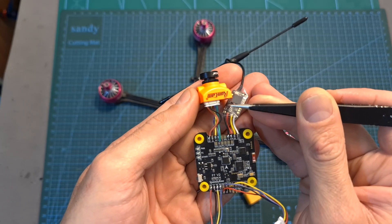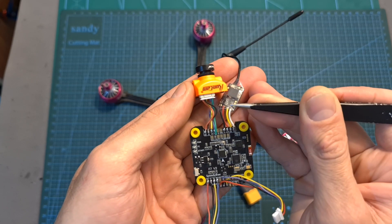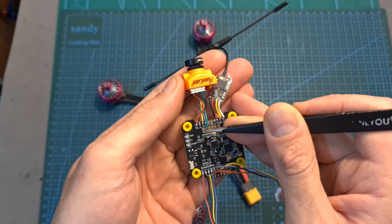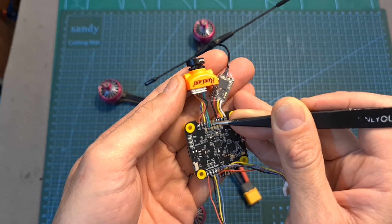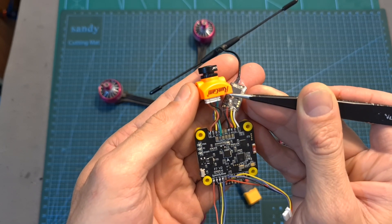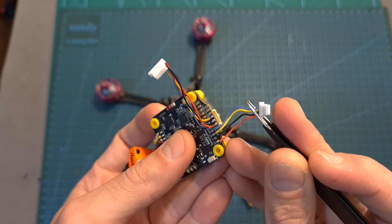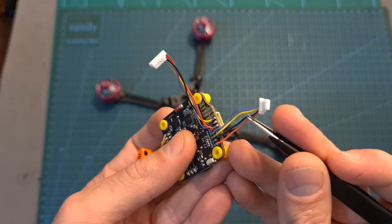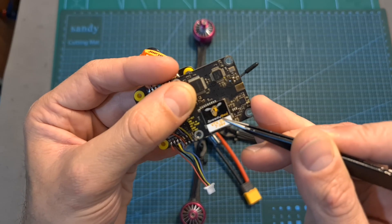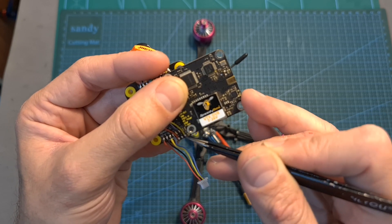As you can see, I've got the FPV camera wired to the relevant soldering pads. Since I'm using the Runcam Racer 2, instead of using the camera control pad, I'm using RX3 and TX3 pads and UART mode to configure the camera. I'm also using the Crossfire Nano SE receiver, a 4-pin JST connector soldered to the GPS pads for the Matek M8Q GPS, and finally the SpeedyBee VTX DVR is wired to the VTX pads.